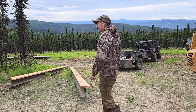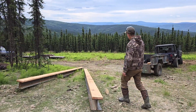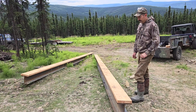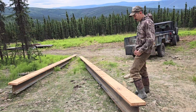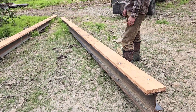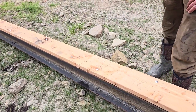Today we're going to try to get some of these beams set. I got the 30-foot beams here — they're W8x35 beams, 8-inch wide flange, 35 pounds per foot. I went ahead and bolted lumber to the top with carriage bolts so I don't have to do it up there, and I marked them every 16 inches for the joists.